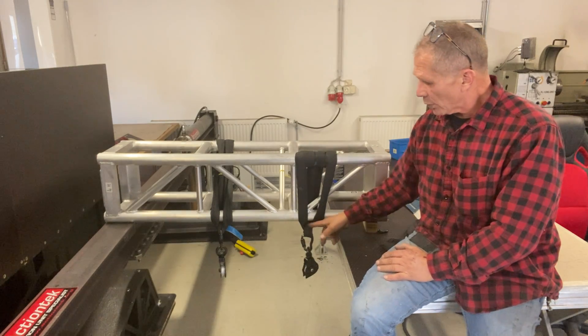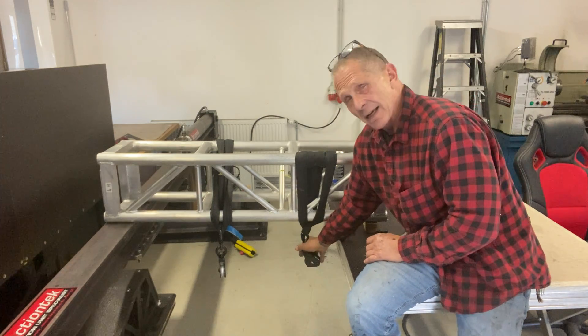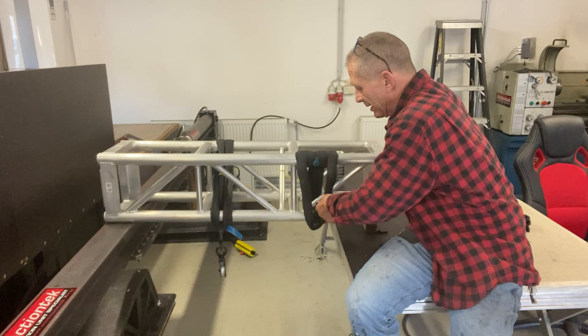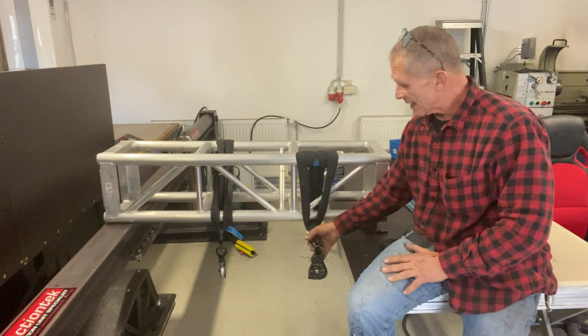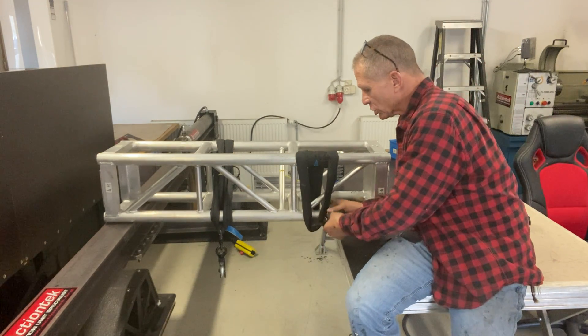Combine that with a poor choke. If this isn't choked correctly — if this is pulled in this direction instead of back against the sling — it's going to slip and gradually keep lengthening out. That's why I always think back choke. If you're not holding it tight against the tube, it will keep creeping.